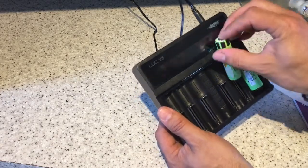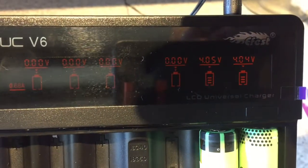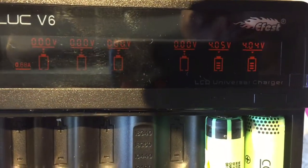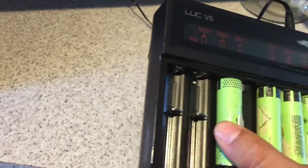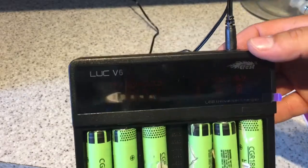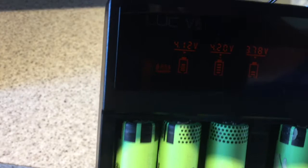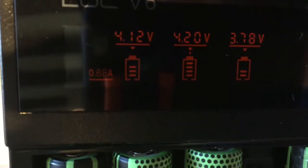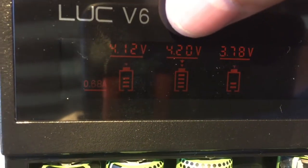Let's just make sure she's driving. So as we can see, I've just put a couple of cells in — apologies for the light there. But hopefully you can see now with those two cells in there, one of them reporting 4.05 volts. The batteries have actually been charged already, but they're not quite to 4.2, which is where they should cut off. So let's just whack them all in. This one here appears to have already charged — it's already at 4.2.